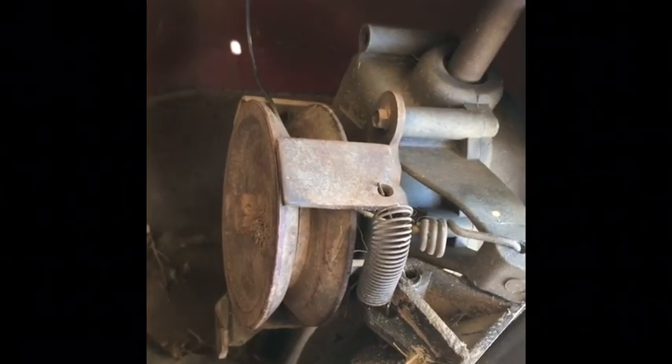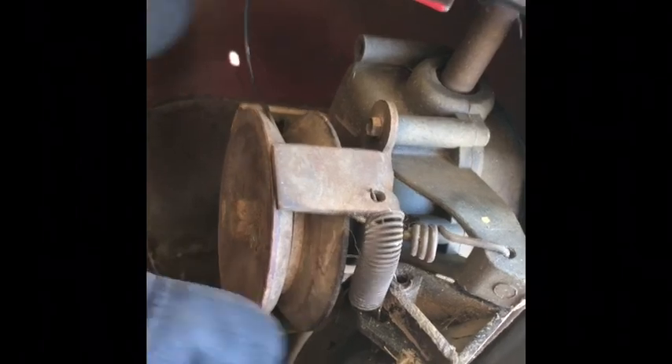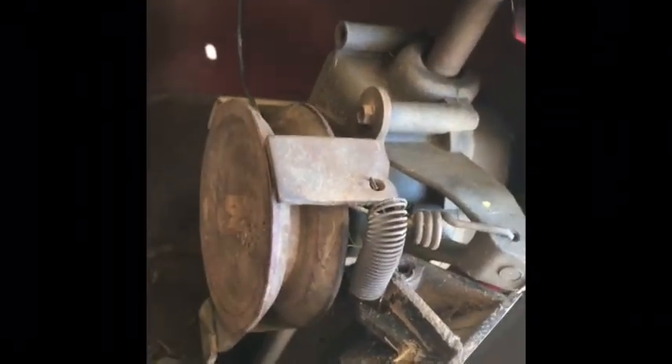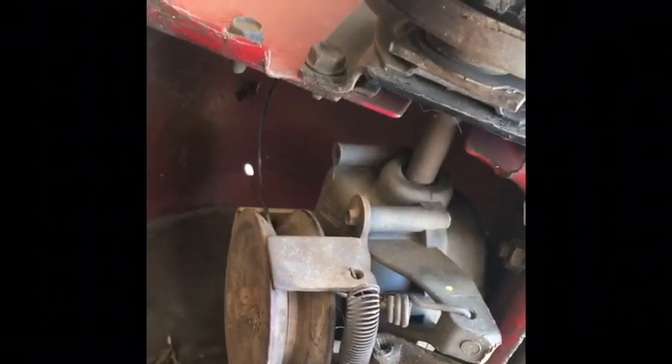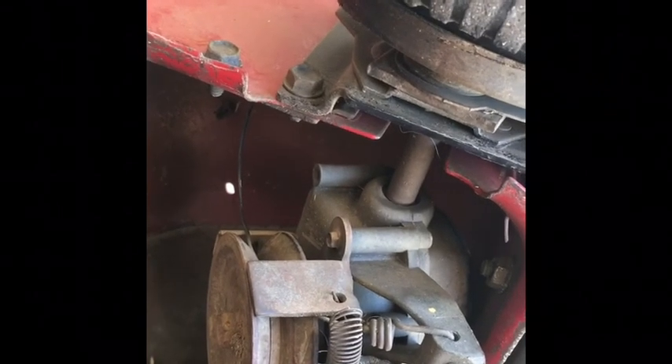I know I'm doing this freehand with my camera — I didn't intend to do this today, I just got thinking about it. Now, in order to get this guide off so you can put the belt on, you've got to take these two quarter-inch bolts out so you can slip the belt over and then see if it'll fit with the drive shaft. Let's hope that works.